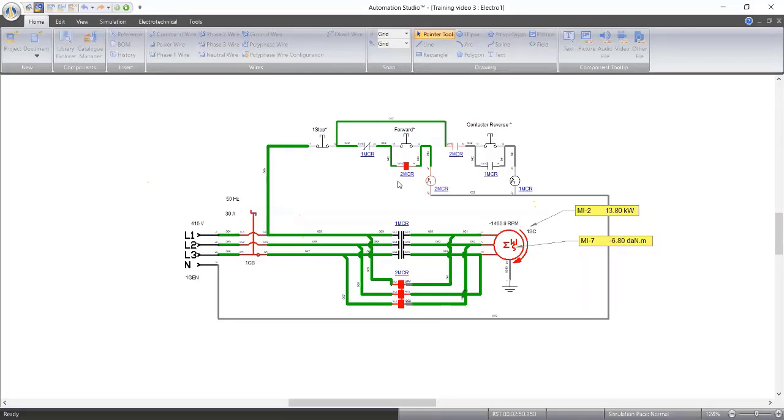But now let's see what will happen with the transient, like that startup current. Let's stop and start the second one. Let's see what startup current can cause. It tripped. Joseph, have I answered your question now? Because we rated our circuit breaker just like our electric motor. Now, what happened when we start? The circuit breaker tripped. If you can hear me now, please signify, Joseph. Because that was the question you asked. The ratings of our electric motor are almost the same as the circuit breaker. Because of the starting current, you can see the breaker tripped.